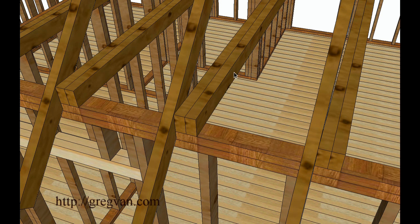Another method would be to drill through the joists and bolt them together. I would imagine 24 inches on center would be fine for 2x4 or 2x6. It might even require a staggered bolt pattern with that. So those would be a couple of methods you could use for attaching the joists to each other.